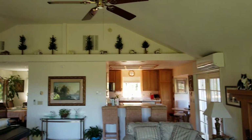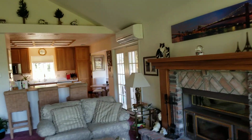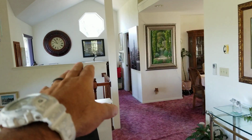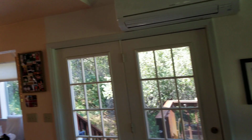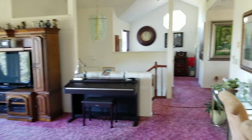And so when you're looking at the place like so, now that throw is, I put it there purposely so that it essentially would throw all the way over to the office space, but it would also draw in return air from the kitchen and from here, which essentially will do a Venturi effect of pulling air back around and rolling it back around to the indoor unit.